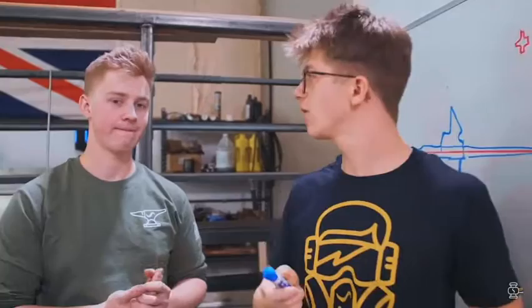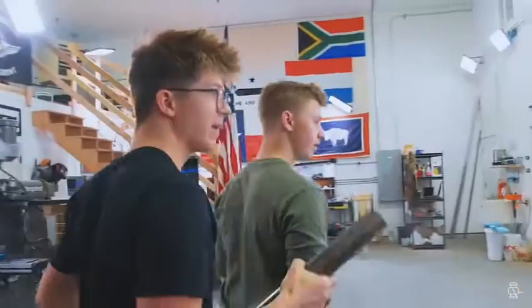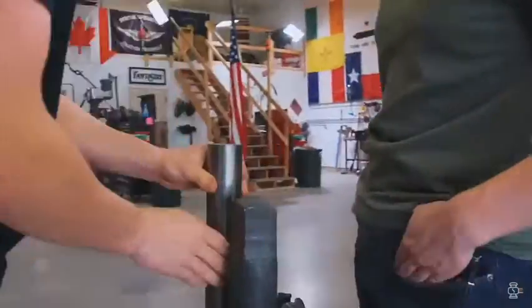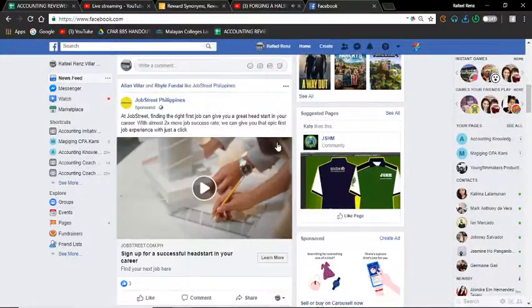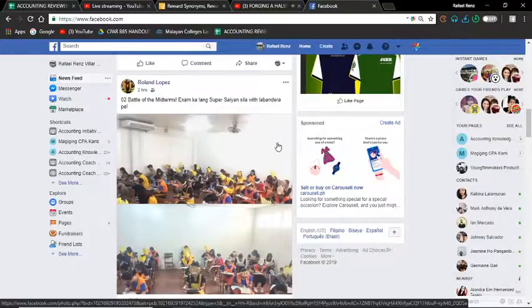I was actually going to start off with thinking 4140, this would be just grand. Got another piece of 4140 over there. So we've got a ton of material options. We could work with mild steel and weld in high carbon cutting edges like you've seen us do in some recent videos. But we also have some pieces of 4140 steel here. And this chunk here, 2.5 inches round, looks like it should be enough material for us.